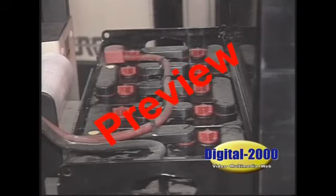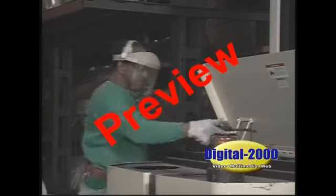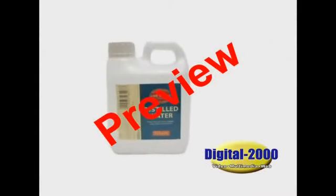If a greasy film forms on the top of the batteries, this is acid and should be neutralized with a baking soda solution. Keep all batteries in a clean condition. Have we left anything out? How about the type of water you should use when filling the battery? The answer is to always use distilled water.